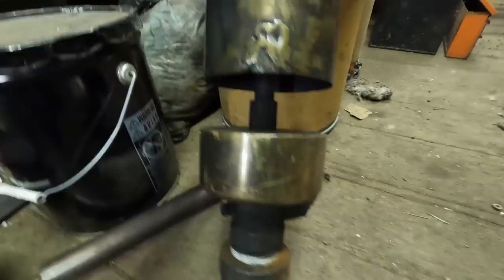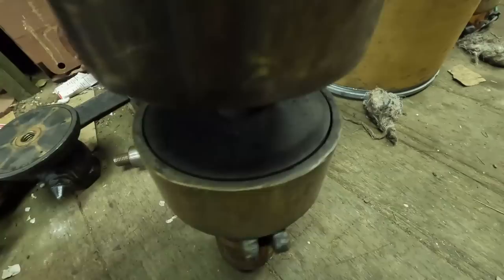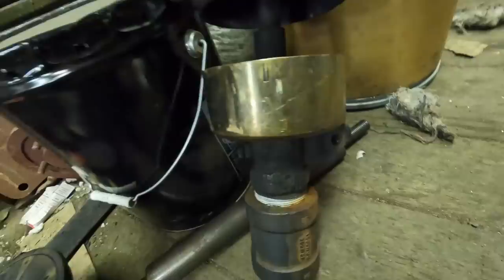Now here we have what's called a hooter whistle. It's a single chime. That's what they called them back in the day. You can see the Languid gap's pretty decent. It has seen some stuff. I believe this is actually a 1920s hooter. I'm sure it's stamped somewhere. So she's had it for a while. But the reason I want to show you this one is that this one is a vertical operating valve style whistle. When I say vertical operating valve, I mean that the valve travels up and down within this pipe here.